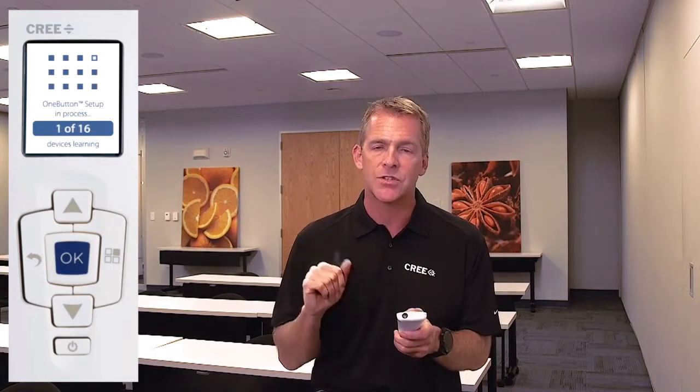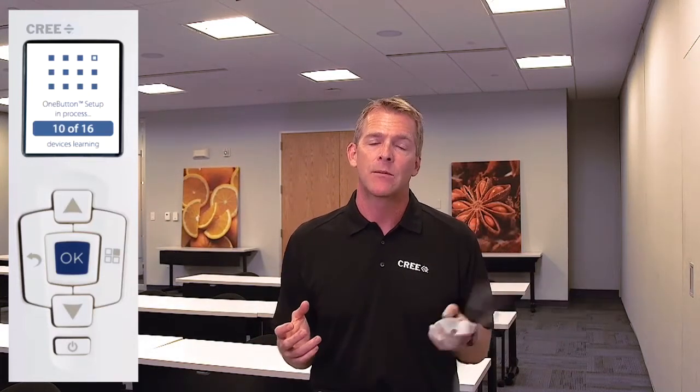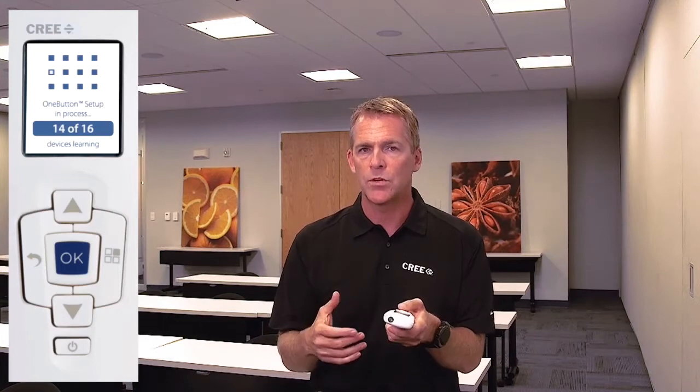The next step is a really cool one. Each light is going to dim a little and flicker at a very specific rate — and that's actually starting right now. As each light flickers, all the other lights look and determine how strong the signal was, building an understanding of which lights should or shouldn't be grouped together. If a light is in the room next to me and it flickers, the lights in this room won't see it, so they know they're not part of that group. There's a sophisticated algorithm behind this that determines what's in the same room, so when you walk into a conference room those lights are associated with one switch — you don't have to go room by room. This takes the complexity out because it just works, and it even works perfectly well with glass walls and open doors.